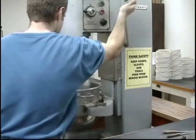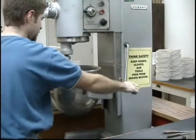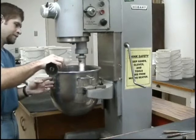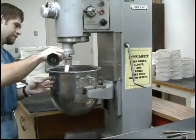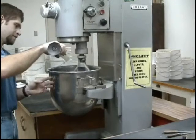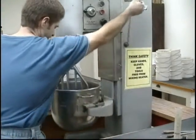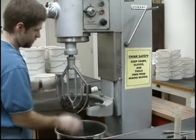After the sample has been broken up, add it to the remaining portion of the original sample and thoroughly mix the two together. The use of a large mixer aids in getting the soil thoroughly mixed. For the second point, the moisture content in the soil should be increased approximately one to two percentage points over the preceding specimen. This can be accomplished by adding approximately 60 milliliters of water and thoroughly mixing to a uniform condition. Adding that amount of water will generally raise the moisture content to the desired percentage. This process is repeated, increasing moisture content in each succeeding sample until the peak density is reached or the density decreases as more water is added.